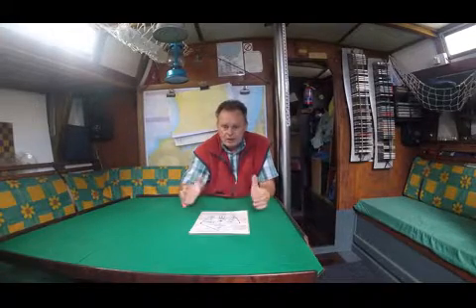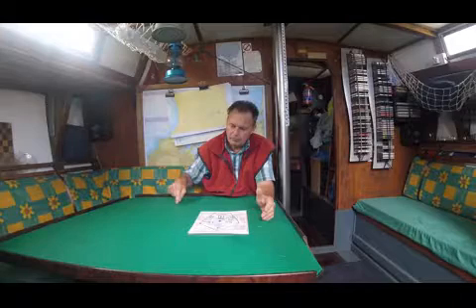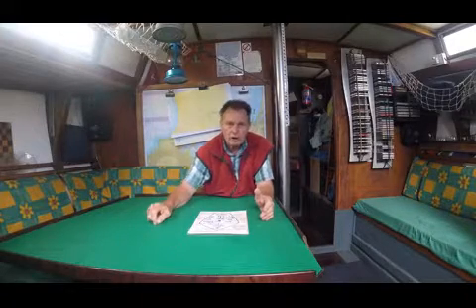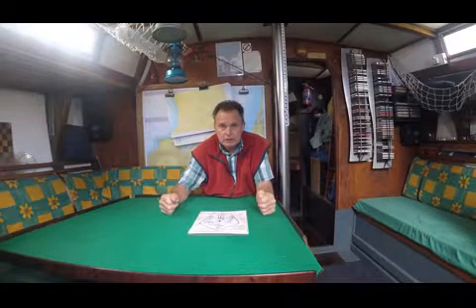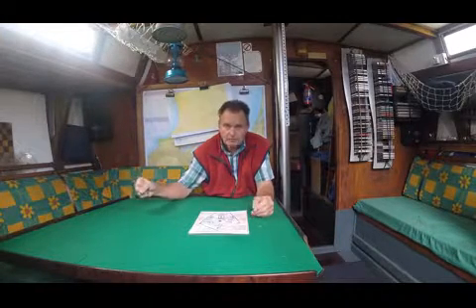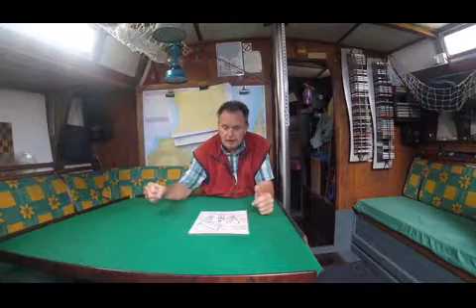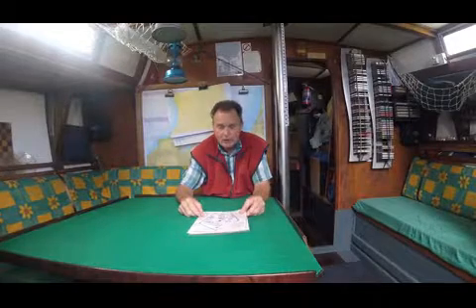What we haven't spoken about are on the outside, on the deck — I have two steel cables running from the bow all the way to the stern, and those are cables that you clip onto. So if you're sailing at night, before you leave the cockpit you clip your safety harness onto the cable, and if you fall overboard there's a short tether so you're not going to disappear. Very important for sailing in bad weather or at night.